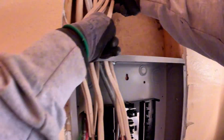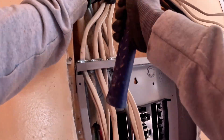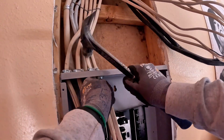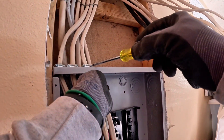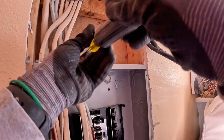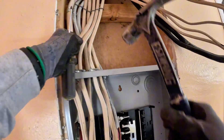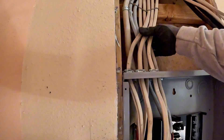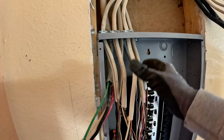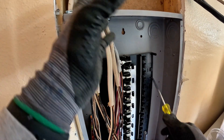Nice and tight, but don't tighten the bottom yet. I'll go ahead and stagger these up to make them look nice — put a little bend in the wire so it looks neat, then tighten that down making sure it's centered. Not too tight — give it a little bend. Beautiful. Now you can cut these back a little bit. You'll have enough slack. You've got all your odds and all your evens, so they just come down and do what they have to do without crossing each other. Make sure you get the odds and evens right.